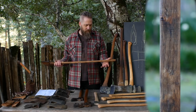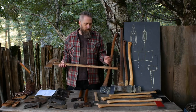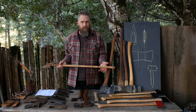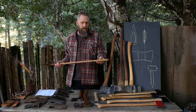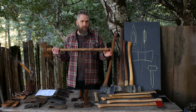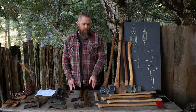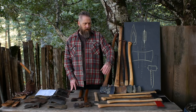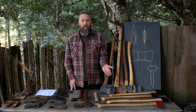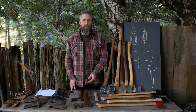The grain does all kinds of weird in-and-out diving around knots, making the wood unstable. Whoever had this before didn't break it, but it's not the handle I would pick. That said, if a knot is down in the handle portion where there's less stress, it's usually not a problem except for stability. If I had a choice between this knotty handle and a white pithy piece of straight wood, I'd still go with this one. Knots in the lower handle are manageable. Also, in hardwoods like hickory, it's generally good to avoid the darker heartwood — it tends to be more brittle.